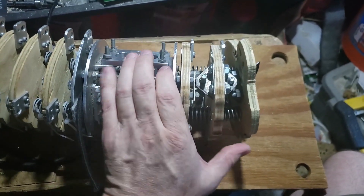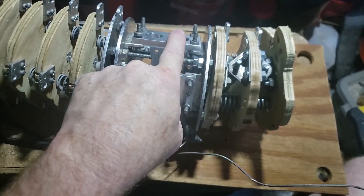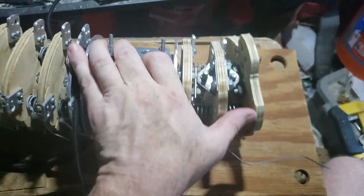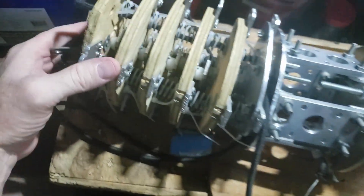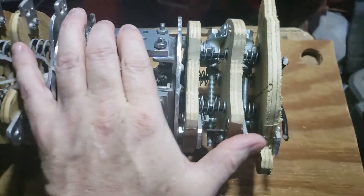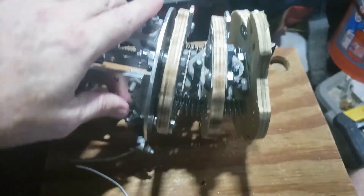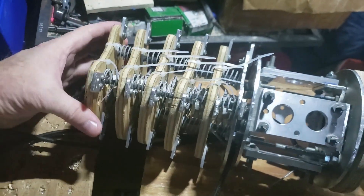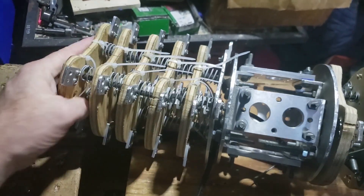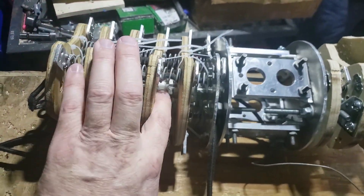These two segments here are going to be driven by the topmost drive shaft coming out of this pillow block here. That's just a single axis that doesn't have a ball pivot like the others - these just have hinges. It only moves forward and back; it doesn't go side to side and it doesn't twist. I have left and right and back and forth on the lower section, but it's compliant in the twisting axis because it's on a ball, not on a journal.